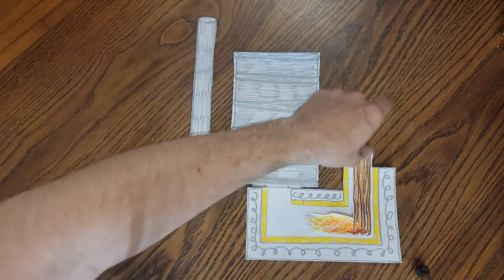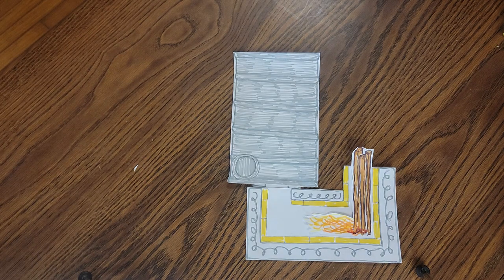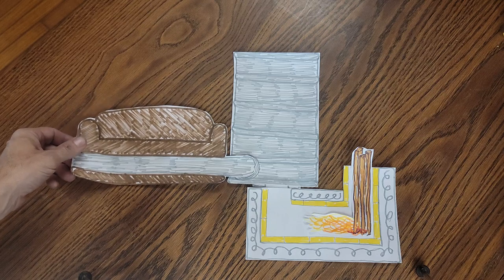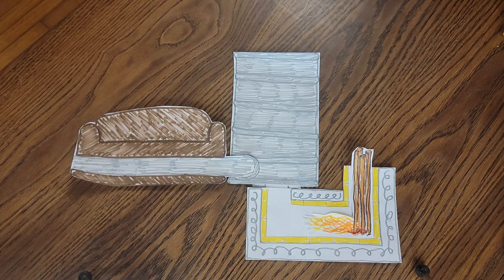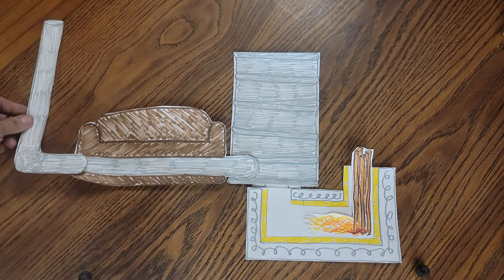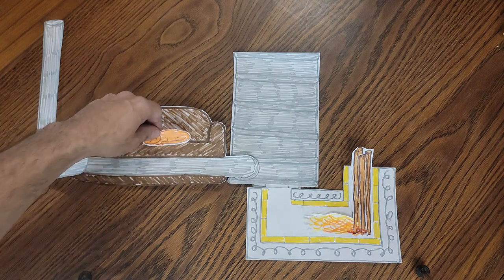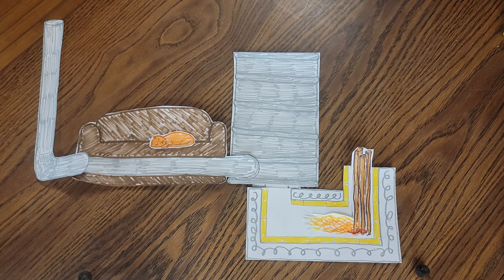Now if you don't want to feed this fire all night to stay warm, then you add a thermal mass battery — that's basically just a big ceramic or mud couch, clay, sandy clay straw, which is what I work with. It's called cob. That gets wrapped around the exhaust before it goes up the chimney and takes all the heat out and stores the heat in the room. And you sit on that mass bench where the cat sits on it, it warms the cat, and everybody's happy.